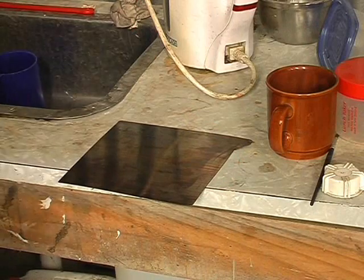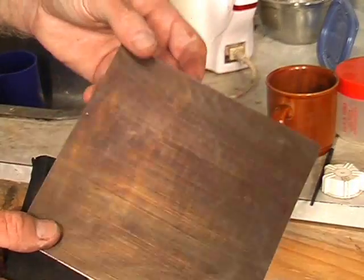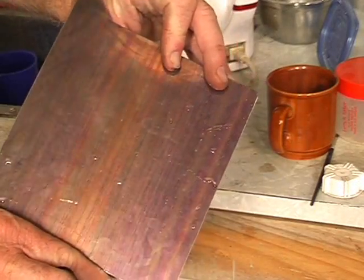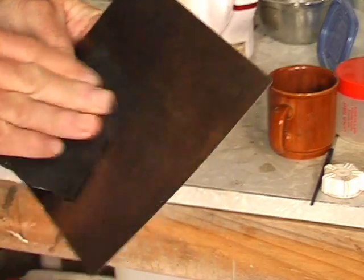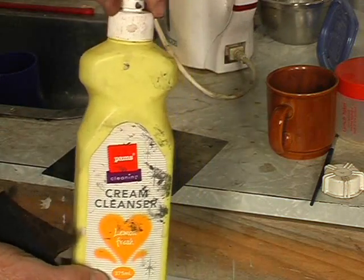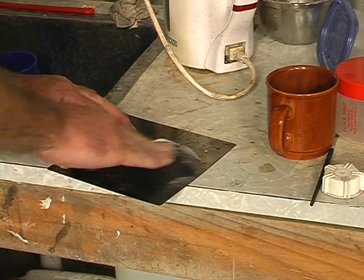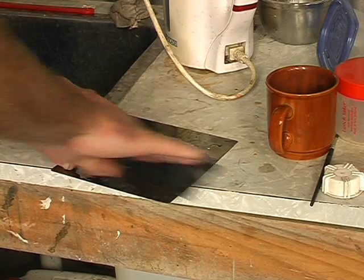The first thing we have to do is make sure that this spring steel is totally clean. It's got a patina on it — that is an oxide, just the oxide produced by a slight bluing process during manufacturing. We've got to get all that oxide off; it should be shiny and silvery, not blue or brown. The best way to do that is using an abrasive. I've got some wet and dry sandpaper here, which doesn't actually do a lot, so I also bring into play some general kitchen abrasive cleaner — sold under names like Ajax, Vim, and Mr Muscle. If you get stuck in with a good bit of elbow grease, you will find that oxide layer will gradually come off.